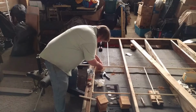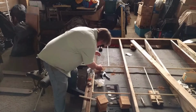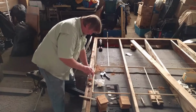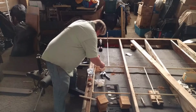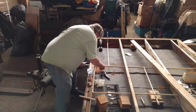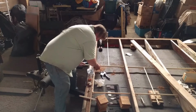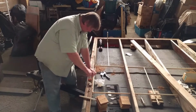I usually work from one end and work down to the other end. I always give it about a 1/2 twist too. Make sure it's set on there really good. A little glue on this one. Make sure you get it well coated. Now I'll put it on here and I'll give it a twist too. I'll give this pipe a twist right here. I'll twist it right here. See? There. I'll let that set up for a second or two here.